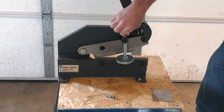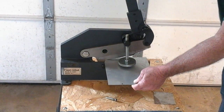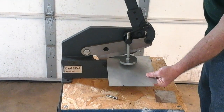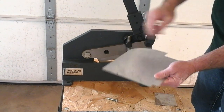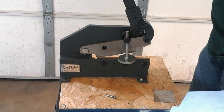Most of the time you're just going to rotate the bottom blade. This is a stop, so if you're cutting something very heavy and you need both hands on the lever, this will keep it from flying up and hitting you in the face. This will cut straight or outside corners — as long as you can reach the handle, it'll cut any length, any width.